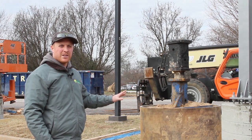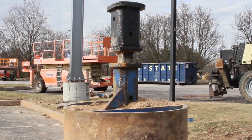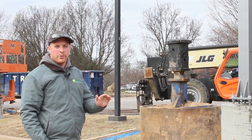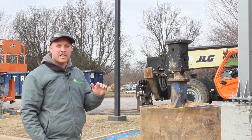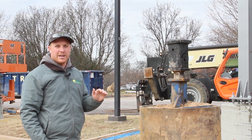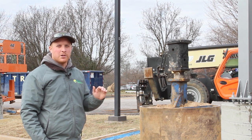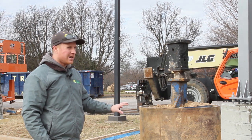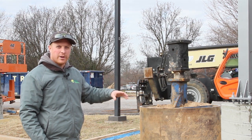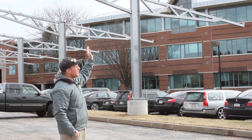This is the metal bit we used to excavate most of the piers. There are some rock formations about halfway down the pier depth, and when we hit those, some we were able to jackhammer out fairly easily. But we also hit some layers of much more serious rock that we couldn't get through, so we turned to this rock bit right here to drill the stone out.